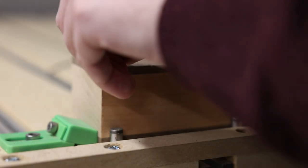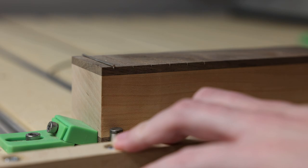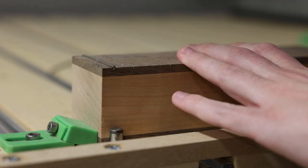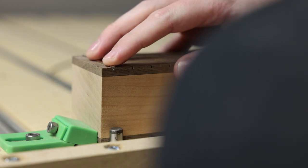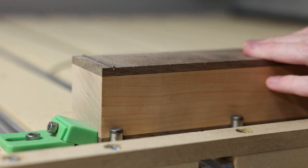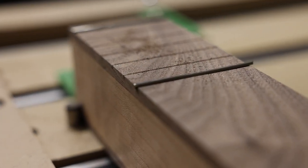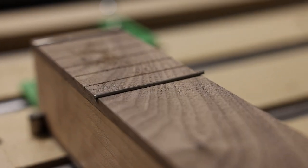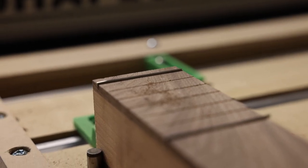Overall I was seriously impressed with how well the machine cut all these grooves. Even at 40 inches a minute at four passes for the entire depth, it didn't seem to struggle at all, and we never ended up breaking a bit. Keep in mind I didn't radius the top — the fret wire was already radiused so the end stuck up a bit — but with an actual radius fretboard I think it would work out pretty well. Thanks so much for watching, be sure to like and subscribe for future videos, and hopefully we'll put this technique to work in the future.